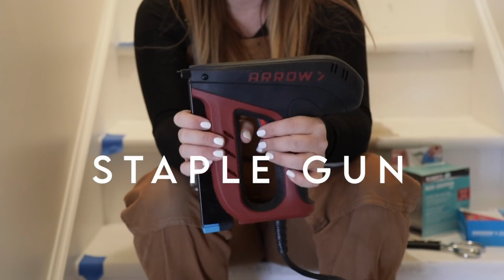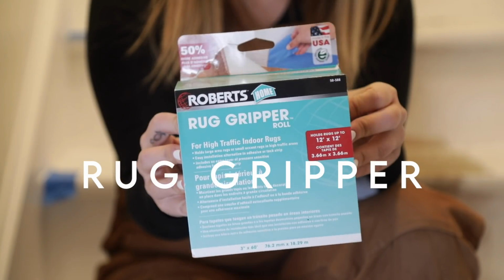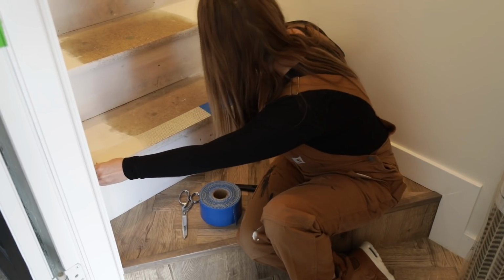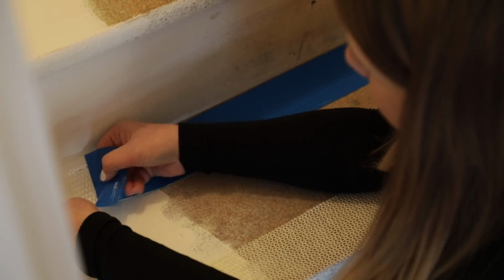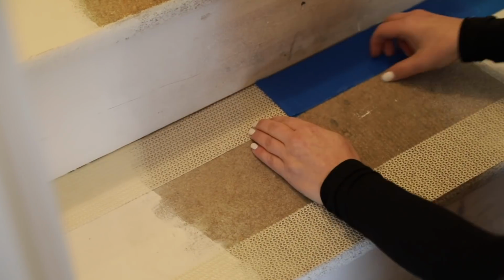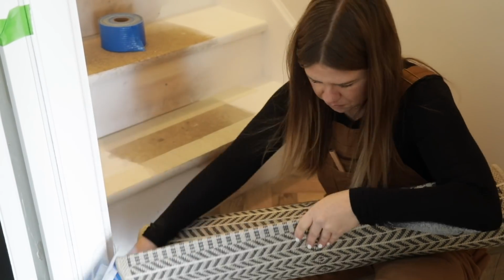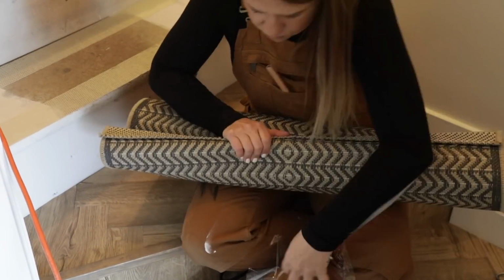The supplies I used were stapler, staples, sharp scissors, and rug gripper tape. Everything I used will be linked in the description box below. On each step, I cut a piece of the gripper tape and placed it on the front and back of the step. This will help the rug stay in place over time a bit, and you could actually use carpet pad here as well. I unrolled the first rug and then I rolled it back the opposite way onto itself so that as I went up the stairs it was easier to handle.